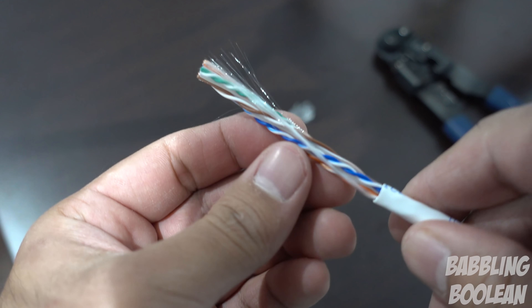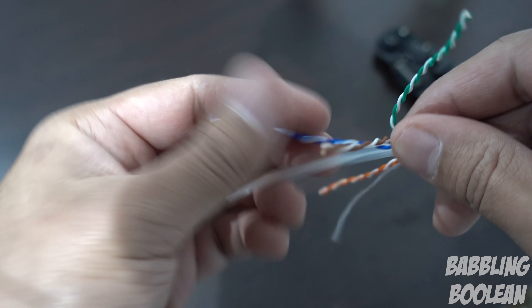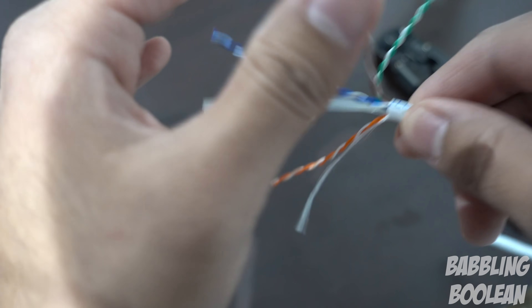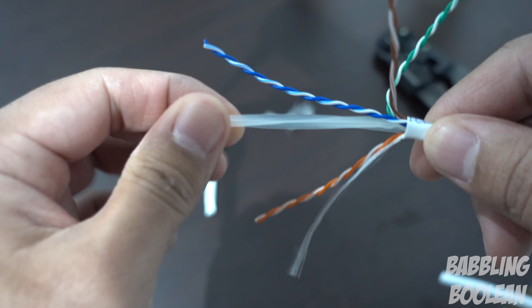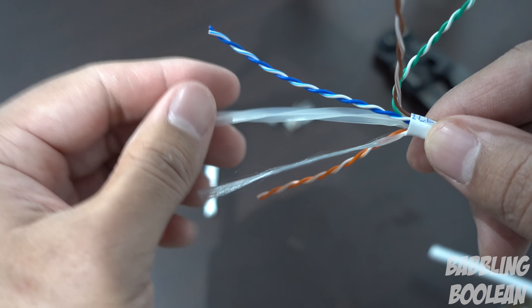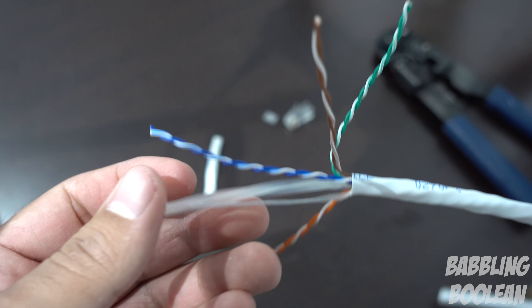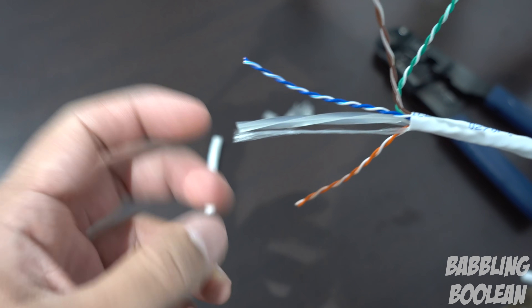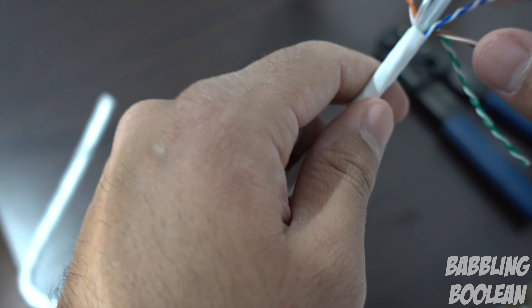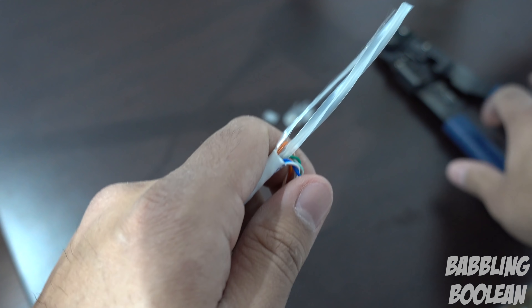This is the idea of what you want to accomplish. You have eight wires inside — split into four pairs — and there's a film in between and a strand on the edge. The idea is that these add filtering inside the wire so there's less environmental exterior noise. The less noise you have, the better the signal. I just fold those to one side to get them out of the way and cut them off with the crimping tool.